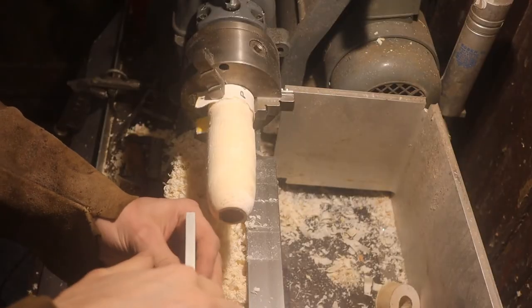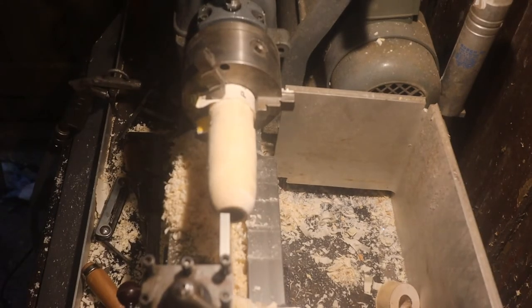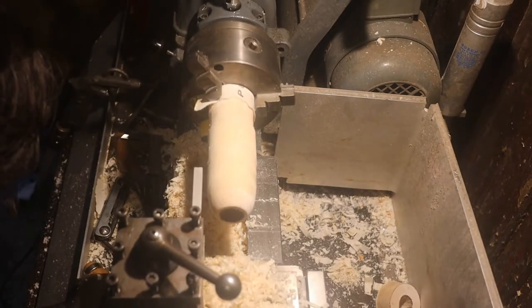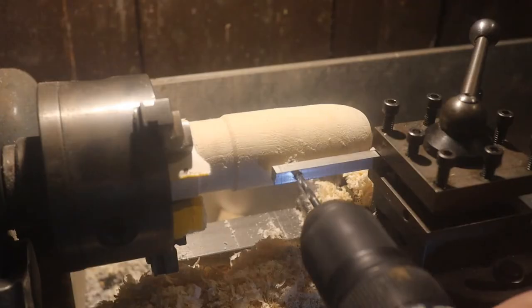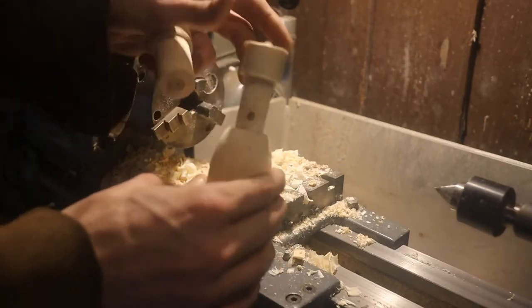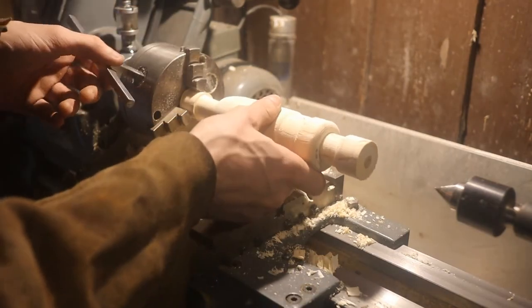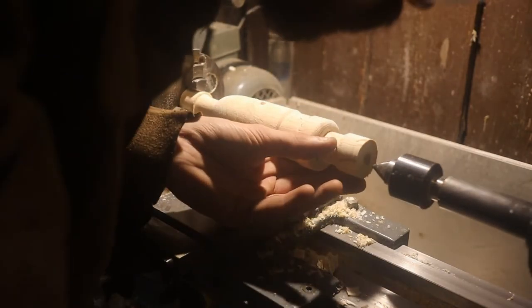So I have this bar on the tool post, and I align it to the roof of the windway, and then I lock the spindle with the back gear. Pretty big no-no, but it lets me drill the hole right at the back of the exit to the windway. A pair of temporary plugs lets me hold the head between centers while I give it a good sanding.